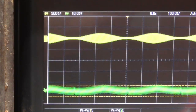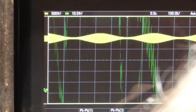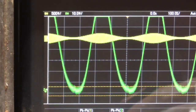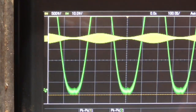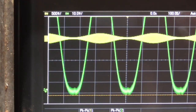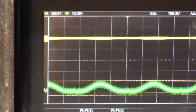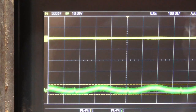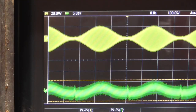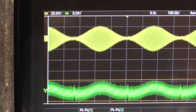Now I'm going to switch over and put in the germanium diode. Wow — going from a silicon diode to a germanium, you get that much difference in signal. We'll bring it down until we're reading 10 millivolts again. We're right at 10 millivolts, and we're reading 47 millivolts input. So it's 10 times better.